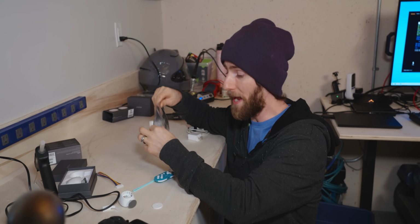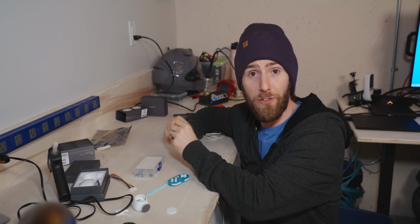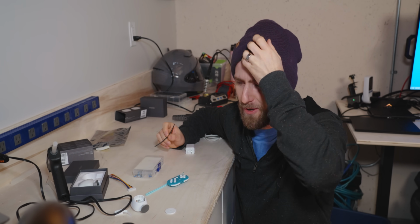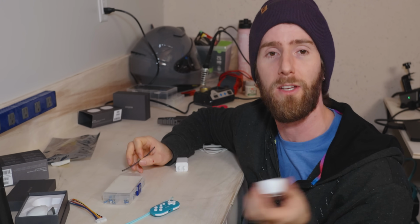There are a number of different ways to step down the voltage coming out of our wall wart, depending on your tolerance for ratchetness. Our first attempt simply used resistors. We did manage to get the voltage down to about 3 volts, but what we found was that once the device actually booted up, it dropped down to 1.7 or so, which caused it to not boot up anymore.